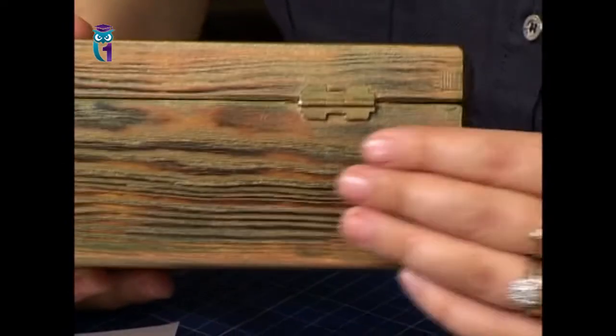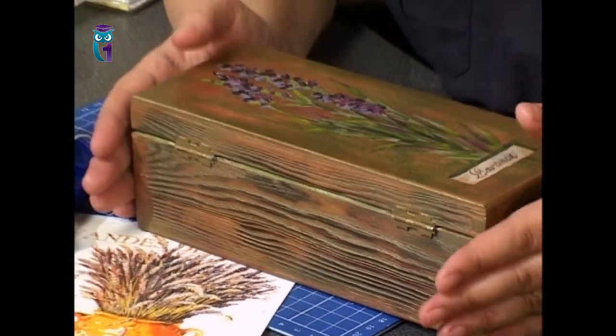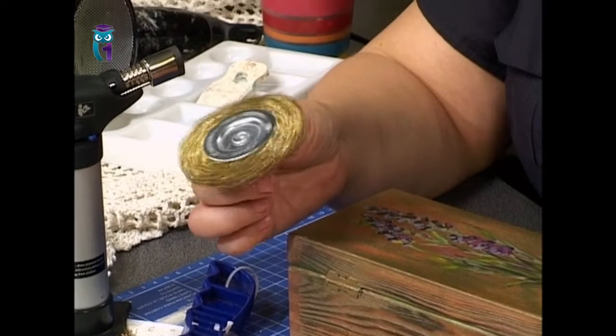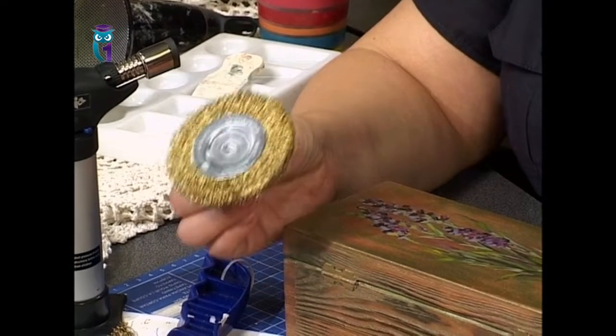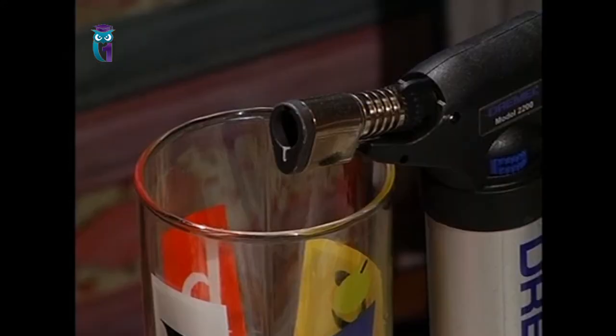And though burning is not such a necessary operation, it simplifies brushing very much. After all, soft fibers are burnt out, and we can with ease clear the product surface of coal. To do the same with raw wood, you need to apply great force, or to use some mechanical adaptations. In other words, you, for example, on a screwdriver or on a drill, should fix a nozzle in the form of a metal brush and work with it. Here you should choose what will be more convenient to you to work with. It will be necessary to try all variants to stop on one.